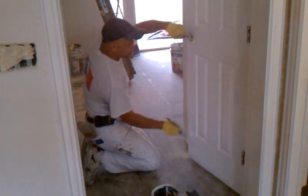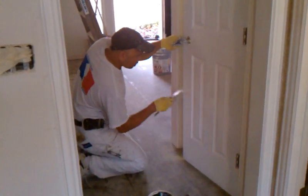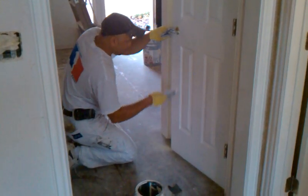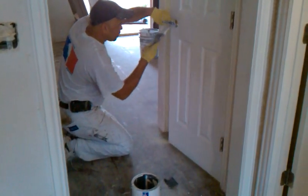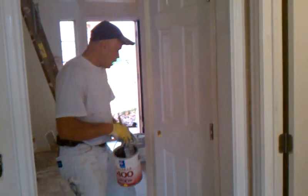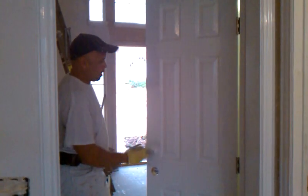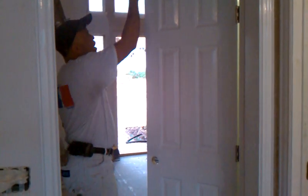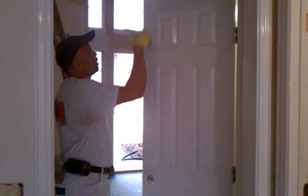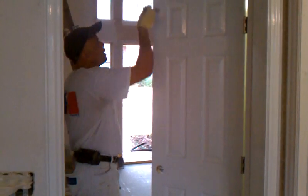I've still got a little bit of working time here. Pay attention to your brush and trash, because the enamel when it dries has a harder finish than latex. That trash will dry in there and then you have to sand it all back down and redo it. So it's better to just keep a clean brush — wipe it down, dust it down.